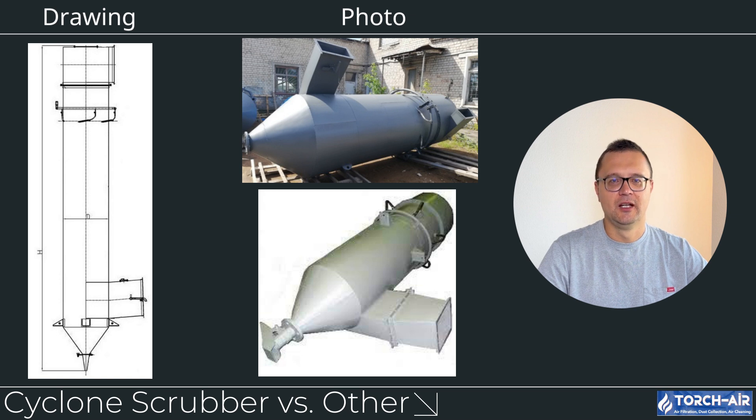How does a Cyclone Scrubber compare to other scrubber types, like the Venturi Scrubber or the Packed Bed Scrubber? A Cyclone Scrubber is ideal for moderate dust and gas loads, particularly in high-temperature environments, and best for industries dealing with mixed-phase pollutants. A Venturi Scrubber is more effective at capturing very fine particles by forcing the gas stream through a narrow throat at high velocity, creating a pressure drop — excellent for tiny particulates, but it requires more energy and has a higher pressure drop. Packed Bed Scrubbers are better suited for gas-phase removal, especially where a chemical reaction is required to neutralize pollutants, but they are not as effective with particulate matter as Cyclone Scrubbers.